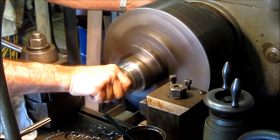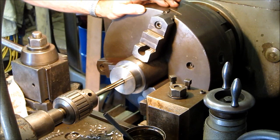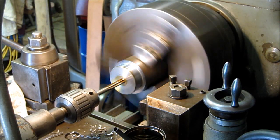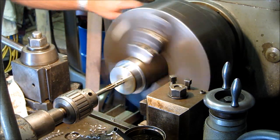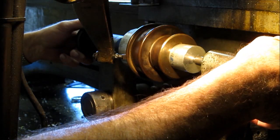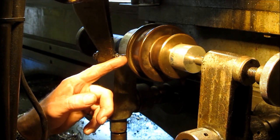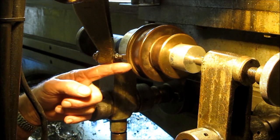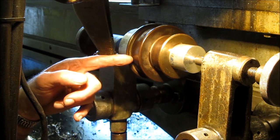That's about an inch, inch and a quarter. We're going to put a little bevel in there just so we don't have any raised-up material, then give it a ream a little slower. Now I've got the unit down here between centers in a rough area. I'm going to be screwing this back and forth — moving this part will allow me to kiss off this face over here. The stylus comes up around here and does this radius. It can't come back in and get that inner area but it angles slightly — you have to feed it pretty slow because you don't want it plunging across — but it will come down to a certain point and start picking up that radius, picking it up on that side of center.